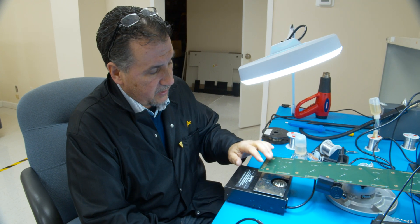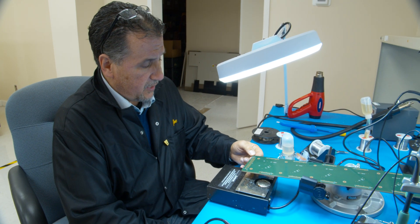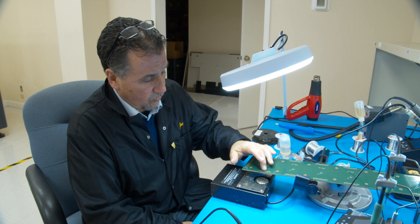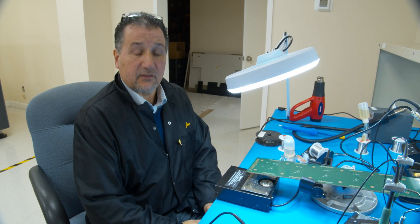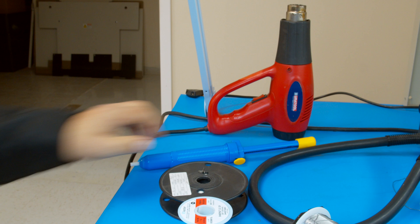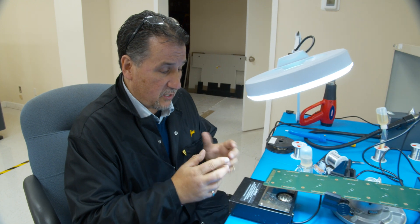The issue we're running into here is I have a board that's an eighth of an inch thick — a multi-layer board with two-ounce copper. Sometimes you have these through-hole connections that are connected to the ground plane, and if you have to clear the solder out of that hole it's very, very difficult. You could use a solder sucker, or sometimes we'll just use straight solder wick, but you can put a lot of stress on the pads and maybe even lift or burn a pad.